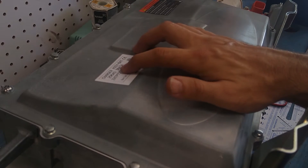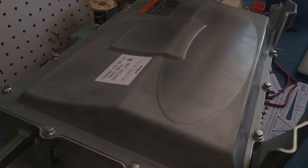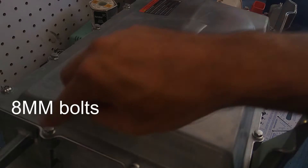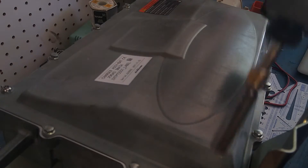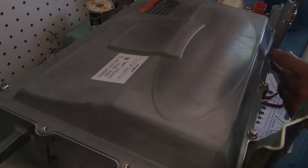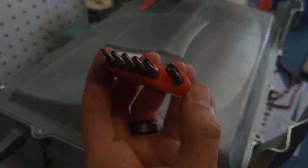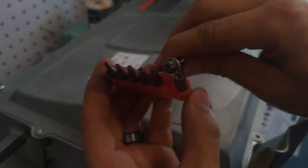Here's our charger — it is the 3NA charger, series 2011. I'll go through the entire process here with you. There are eight-millimeter bolts all around — looks like 13 of those to undo. Then we're going to use a T30 bit, but these ones are special security bits: they have a little dot or groove in the center. You'll probably have to special-order this bit because they're not common off the shelf, so hit up Amazon and grab the special T30 bit.